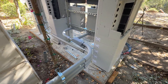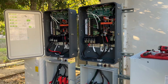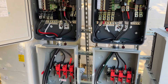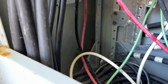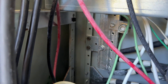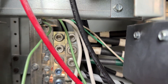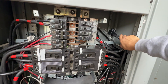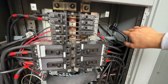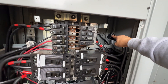This is the back side. In the main electrical panel, we're going to replace the lugs for the neutral because all of them are occupied — I'm going to install this double lug. Here are all the wires. We're using insulated lug connectors to intercept the sub-panel from a breaker. From the breaker, it goes to the hubs, then comes back and goes to the sub-panel.